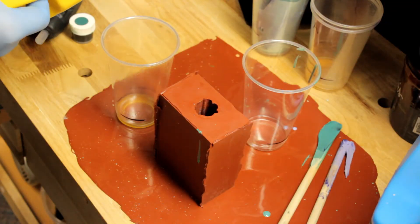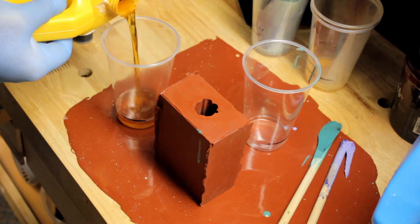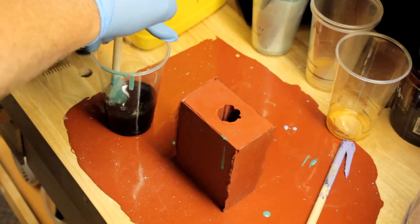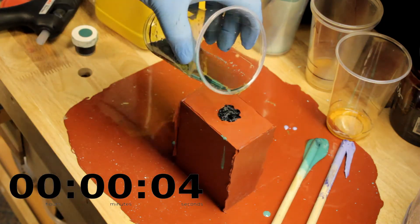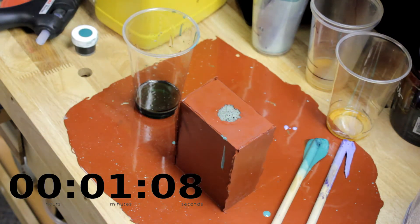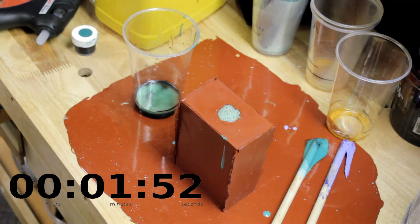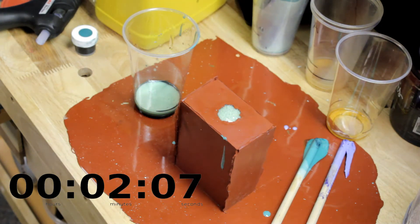The Smooth-Cast 320 is a volumetric measure one-to-one — one part of part A, one part of part B — and it's a very fast set. I add in my own Smooth-On pigment colors. You can get a whole series of colors for under $15, maybe up to $20 now, but it's worth it. Use a small drop of that color additive into the urethane and it turns it whatever color you want. I messed around with that a little bit and got about 10 handles off of that.